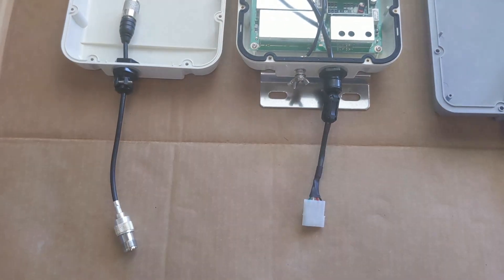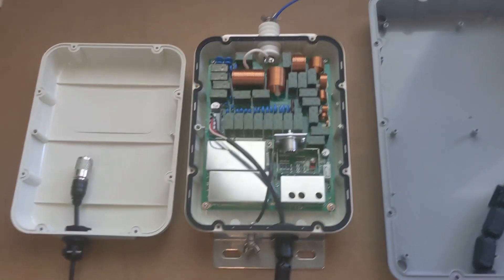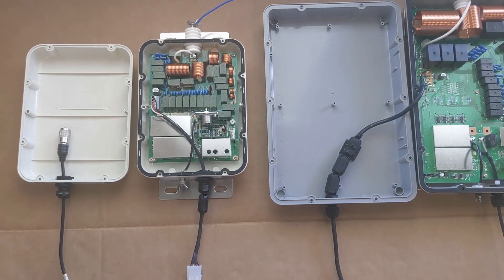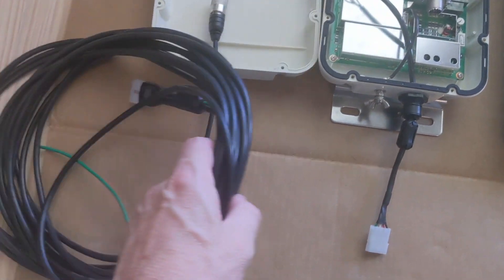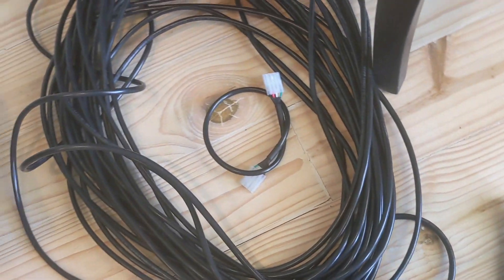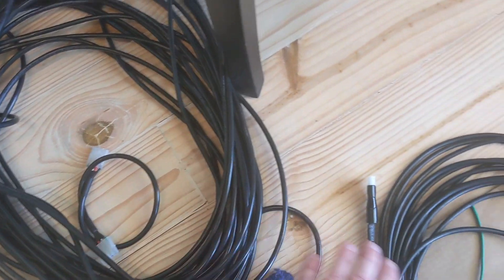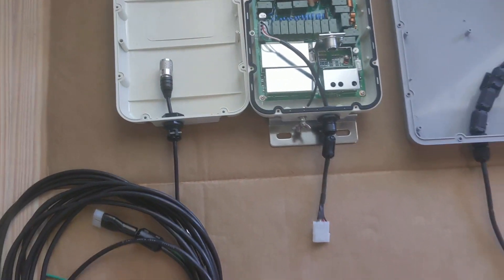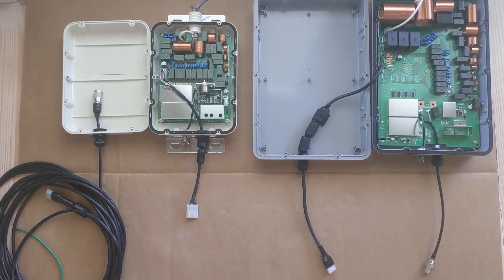I went ahead and pigtailed this one. I was really wanting to do an A/B, but I can't — not right now. A lot of people have asked about cable length. The factory tuner cable that comes with it is usually around 30 feet, but last night I went ahead and made a 100-foot cable. I also made this piece to join them together to make a total of 130 feet. So let's see if we can get these tuners to tune with 130 feet of tuner cable.